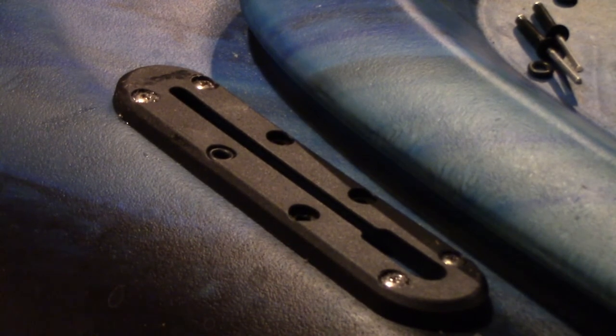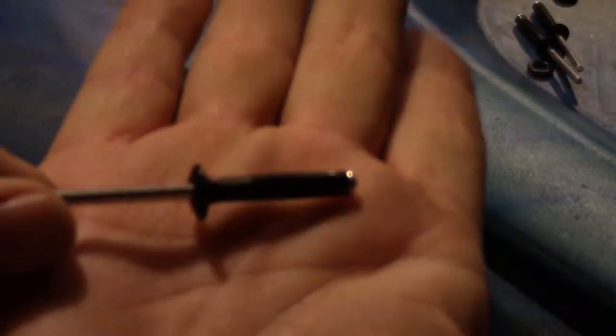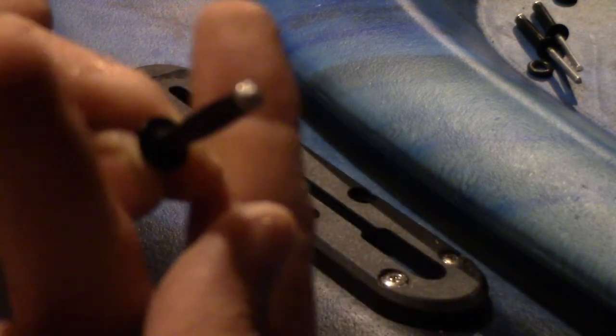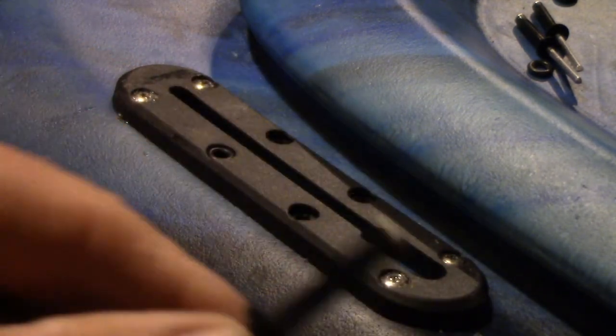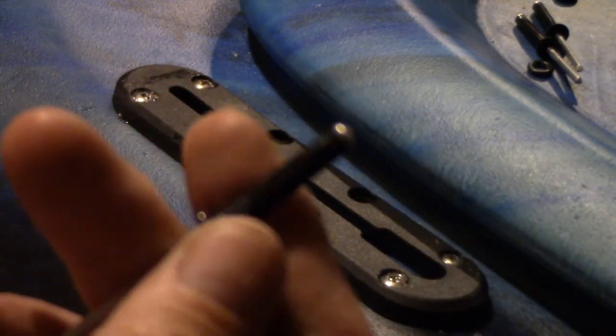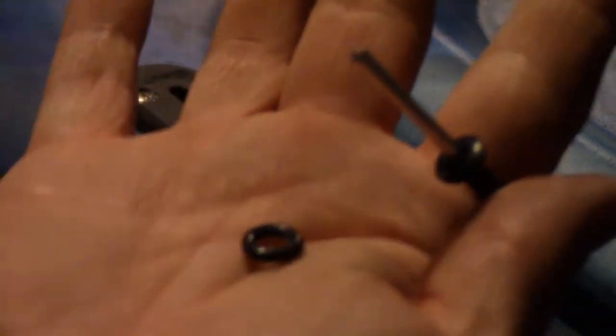Okay, so I'm not sure if you can see this, but this here is the kayak rivets. They're tri-grip, so when your rivet gun or rivet tool pulls the rivet through, the backside expands into like three spots of anchorage, an anchor that's in three spots. And these ones, because they're for kayaks, they also come with a rubber washer. And this is the interesting part.